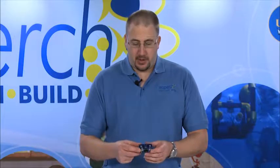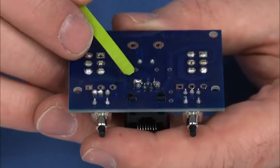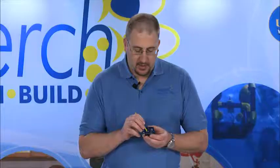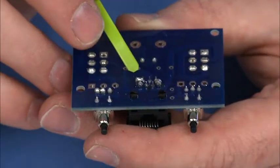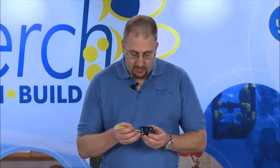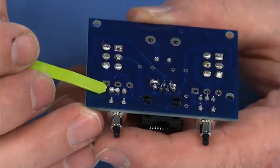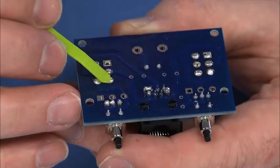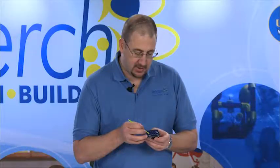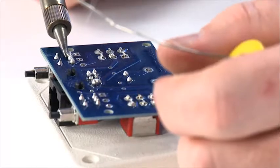Now I want to go through some examples of joints that may cause problems in the operation of your SeaPerch. Here you can see an example of the first problem, where we have two terminals that are connected with a single piece of solder. This no longer allows the proper circuit to be built and can short out your controller. The other type of problem is incomplete joints — where you have a ball of solder on the post for the switch that doesn't connect to the circuit board, or joints that don't have enough solder, where you can see openings between the switch and the circuit board.